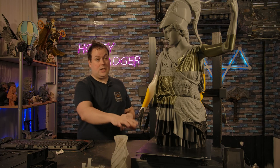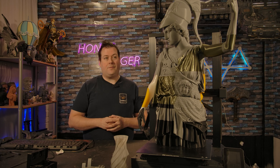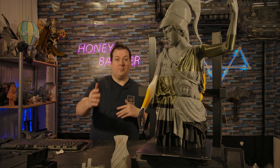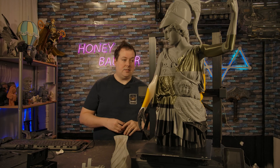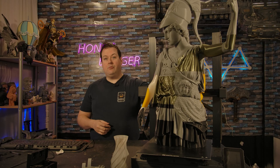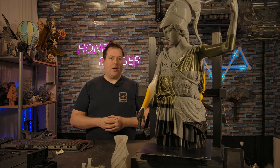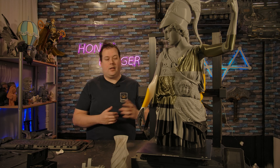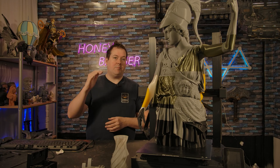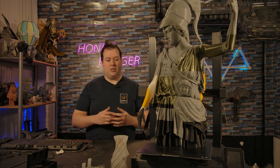As you can see, we're about halfway through an Athena statue for a commission job, and the Sidewinder has done all of this in a variety of filaments — using up extra stock we had lying around. It's done a really good job. Features: it's a 300×300×400 build volume, you get a filament runout sensor, dual Z motors and dual Z lead screws, linear rails on X and Y — dual linear rails on Y. Artillery claims 500mm/s, which fundamentally isn't true, but it is still quick. We've done all prints here at about 150mm/s, which is pretty much the sweet spot.